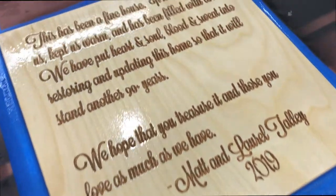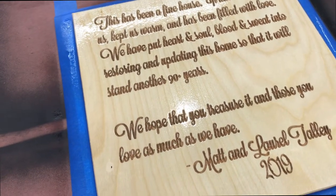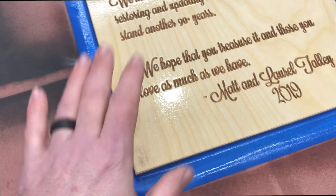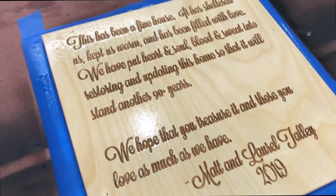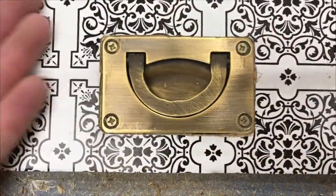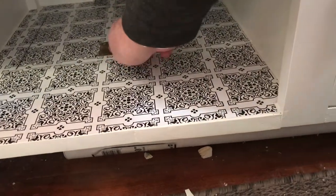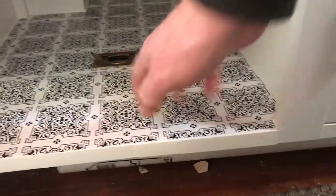Here's the first coat of clear satin finish. I'll let this dry, sand it with 220, then lay a couple more coats on. I made sure to tape off the bearing edge because you don't want painted or poly surfaces mating up — they'll stick and be glued forever. I went with a classic bronze brass hinge; it goes well with the cabinet, and the hatches just kind of disappear unless you look real hard.